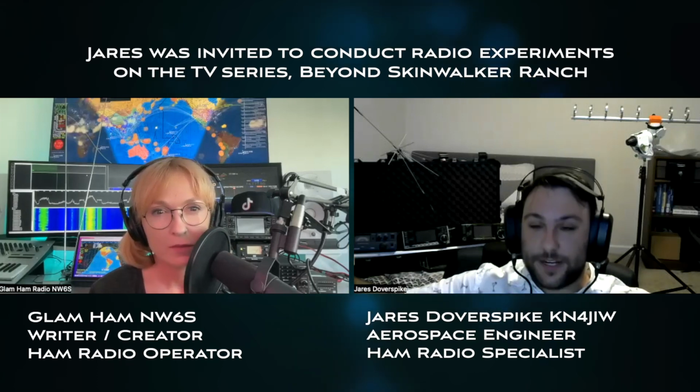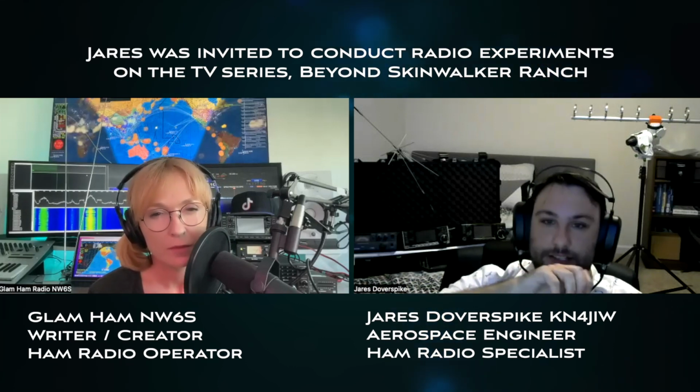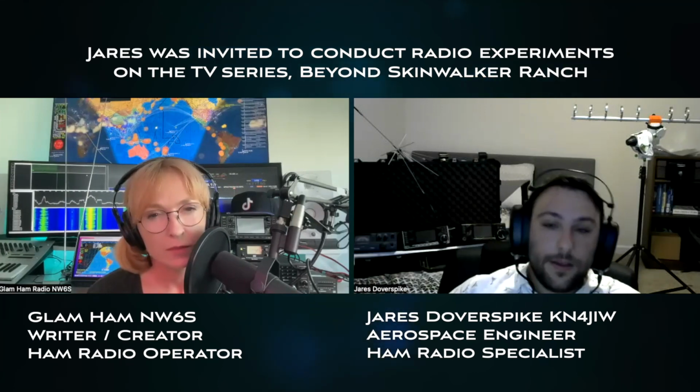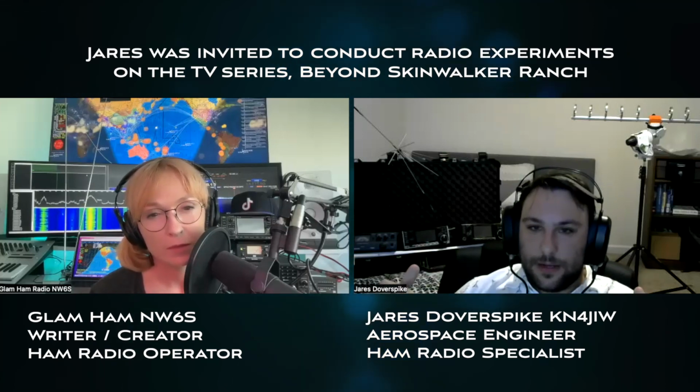So the effects that we were seeing weren't necessarily limited to 1.6. We were seeing general energy levels across the entire spectrum. Okay. That's what you see on your RTL SDR, sometimes it'll do a noise adjust and that sort of thing. But we were seeing that far more than I've really seen here. And I've even seen, whenever I was doing it in cities near universities that are doing different RF experiments, one of the things that we were seeing is it being far less stable than what it was previously.